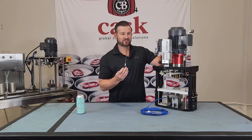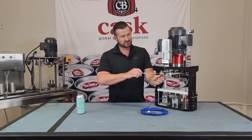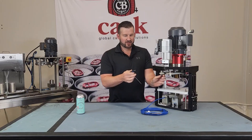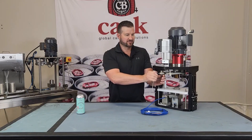To do that you're going to need a four mil allen key. You're going to hold the bottom of the cam follower and loosen this bolt. Rotating the cam follower closer to the cam is going to move the die closer to the chuck, and further away is going to move the die further away from the chuck. Once you have it where you want it, tighten this up. Be careful not to use the ball end to make that final tightness adjustment, as this can strip these screws.